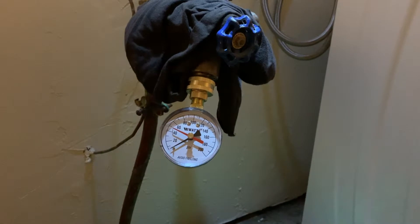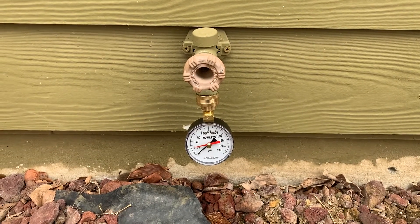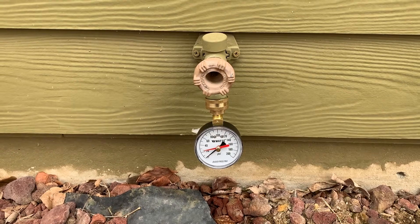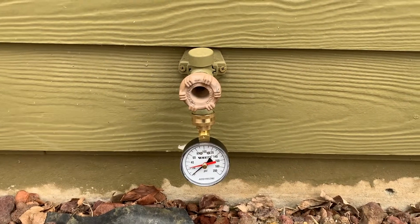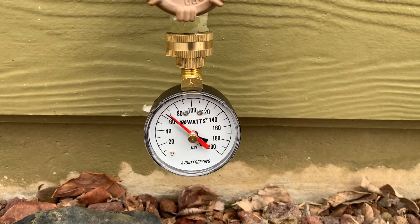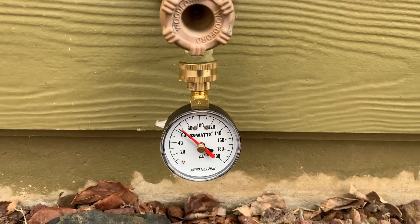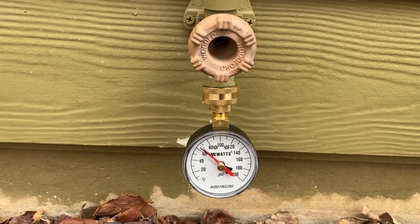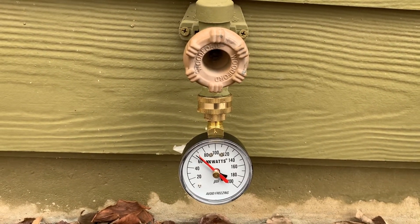Now I need to figure out what the water pressure is on the other side of the pressure-reducing valve. I'm out in front of my house at a spigot. My basement is drywalled so I don't have anywhere to connect this past the water pressure reducer. This pipe, while it's a bit of a walk, is actually only probably 15 feet of pipe from where I was before. So I'm just gonna turn the water on and we'll see what kind of pressure we have. We're sitting right about 63-64, and the red dial measures the highest point this device measures — a lot of people leave this on overnight or for a couple days to check for any spikes.